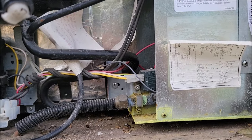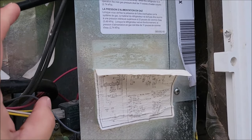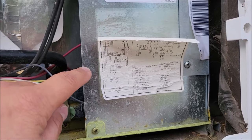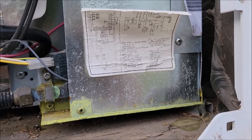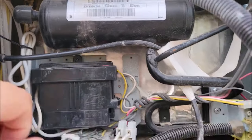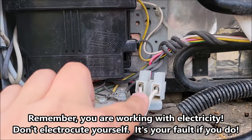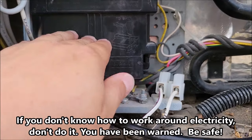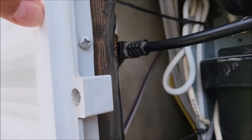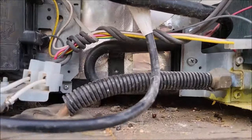The reason our panel is completely dead on the inside is because behind this panel there is a little fuse — more like a breaker — that will just pop and won't power anything. That happens because the boiler back here had a leak, was running low, and it's there for safety reasons — it turns off on purpose. So that's the problem there. But if you don't have this problem, you want to come back here and check. These are your 12-volt leads in, this is 12-volt in to run the control panels, and there's a control board back here. This is your RV 110 plug — there's usually an outlet on the side for the refrigerator when running on 120-volt — and then of course you have your propane here, which runs your boiler also.